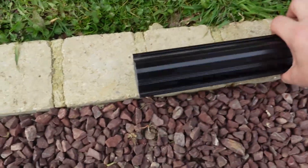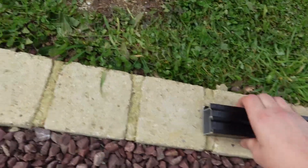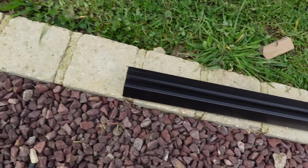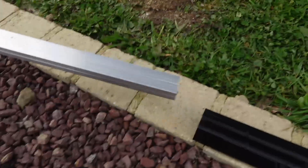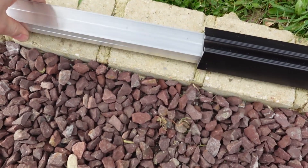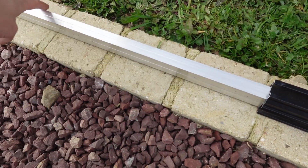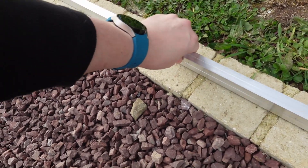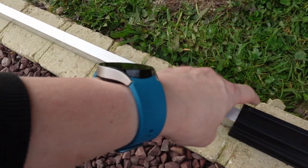The solar rail accessories go into these channels and it's actually hollow aluminium. Jude had the idea of going to buy some aluminium tubing — just hollow aluminium tubing, quite cheap from the hardware store — and we can slot it between the two rails and then cable-tie the cables at the back of the rail, which is what I've done. I've also put the earth cable and everything inside trunking which is then hidden behind the rail, and I sprayed the rails black.